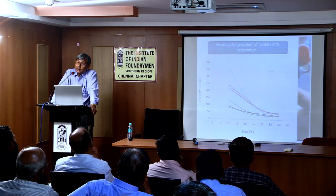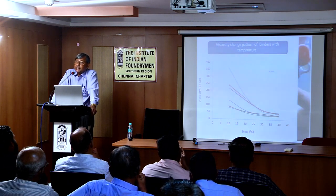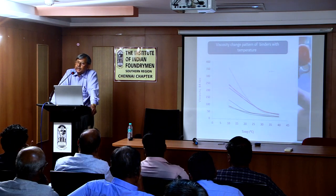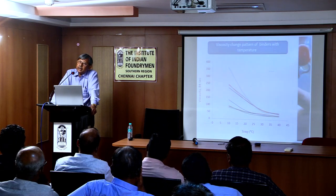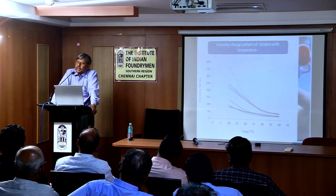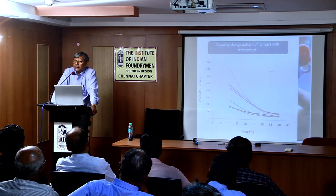What would you prefer? In a country of extreme conditions like Iran, I visited Iran. There are a lot of foundry components. I did not have an idea about it, but after visiting there, I found that their temperature was minus 12 degrees centigrade, and my material was not coming off the barrel at all. So, friends, for extreme conditions, you need to choose the composition of the binder.